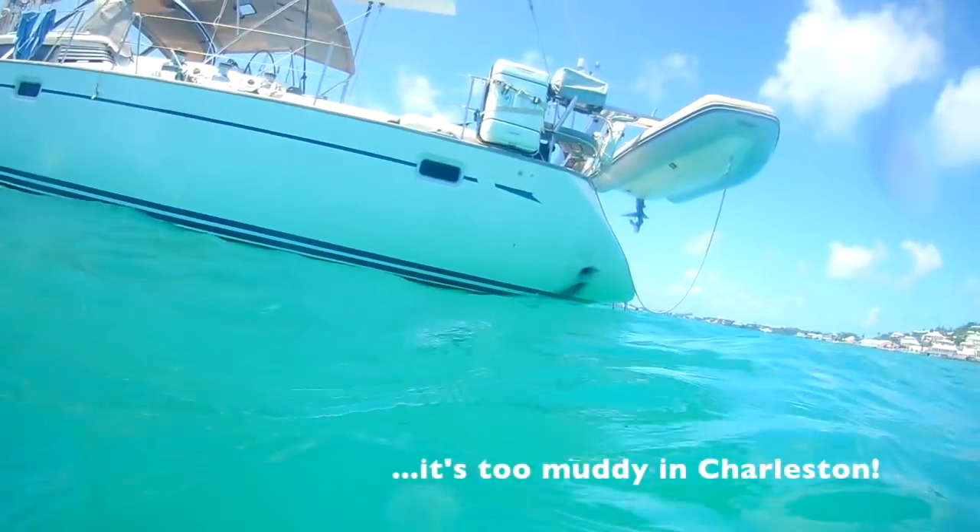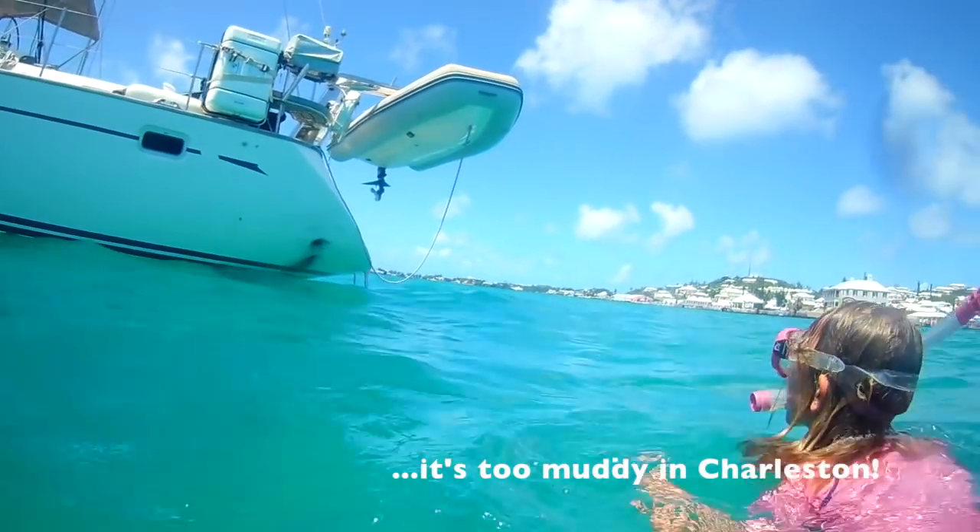Dive on your anchor if possible, and consider re-anchoring if needed. If you're in clear waters and it's easy to dive on your anchor, go down and check it out. Make sure it's firmly set, and look at the chain along the sea floor. Over time chain can rub on rocks and get damaged, or hit reef and destroy it. In strong tidal areas anchors can get dislodged, chains can get tangled in rocks and reef, and the effectiveness of your ground tackle can be compromised. Just because your anchor has been set for days doesn't mean it will always stay set.